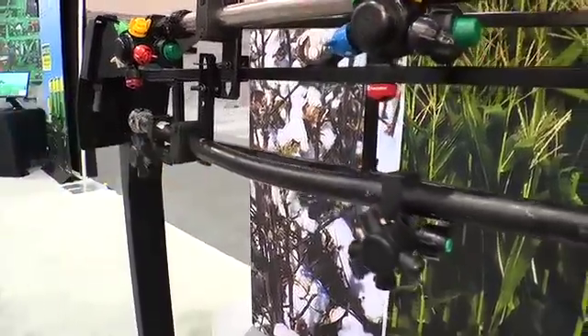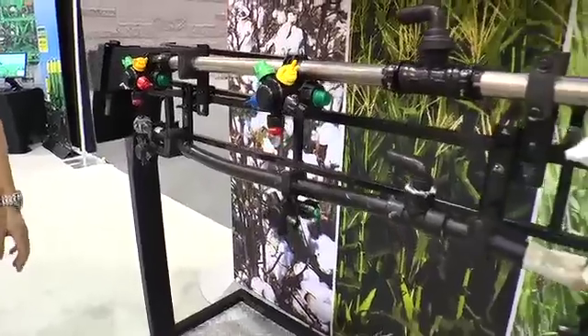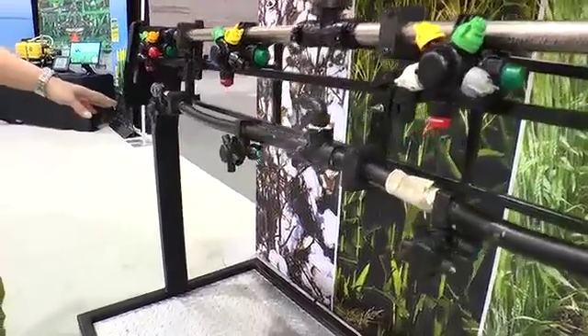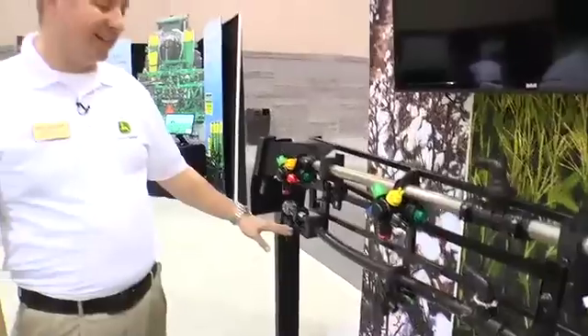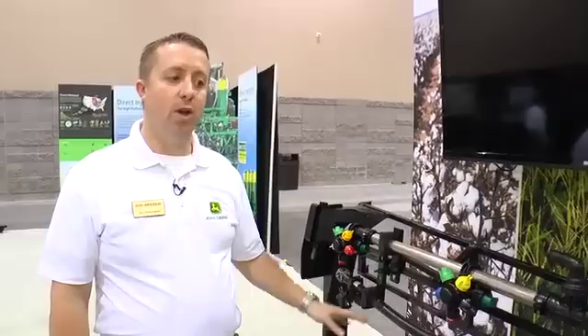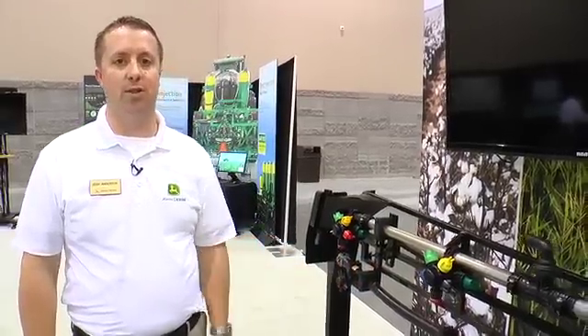You see the warping occurring here, and not only is that a cosmetic and visual concern that will affect the value of that machine, we also know that it disrupts and compromises the spray pattern. So we have inconsistencies in the height as well as the angles that we're spraying, and we need to be making our best effort every time that sprayer makes a pass through the field to help our customers succeed with the challenge of herbicide resistance.